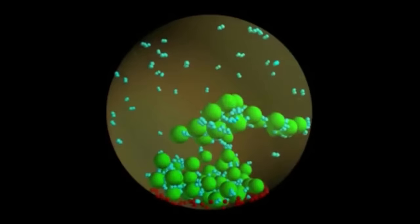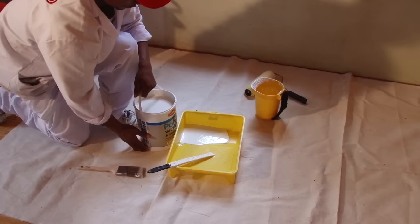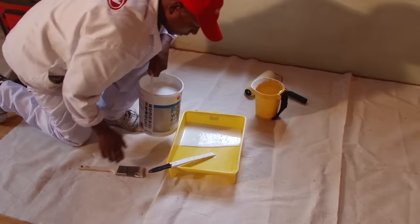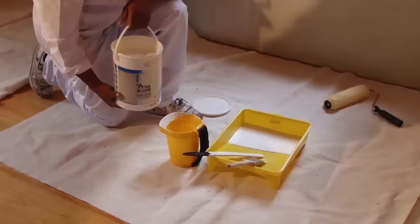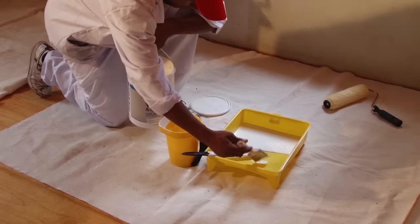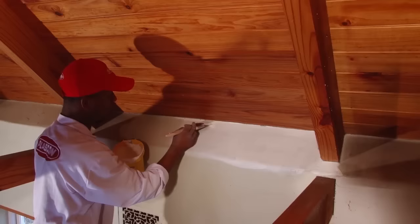The first thing to do is give the paint a stir. Paint has tiny particles in it that will sink to the bottom of the can over time, and stirring will suspend these particles in the paint. It's a good idea to pour over the front of the label so that the instructions on the back of the can are not hidden with paint overspill — in a year's time you may want to use the leftover half can and will likely want to read the instructions. Always pour over a drop cloth to protect the floor or carpet from paint splashes.